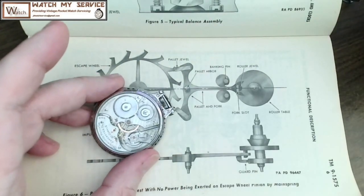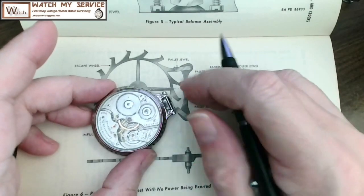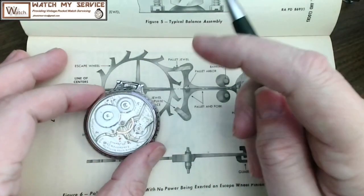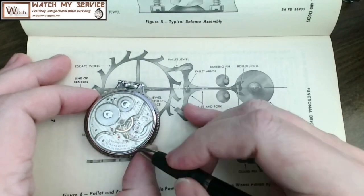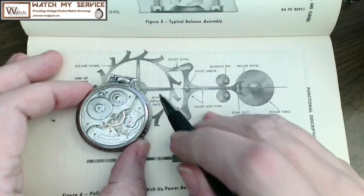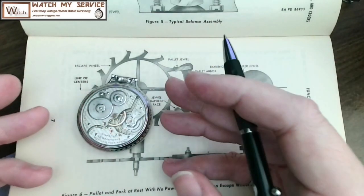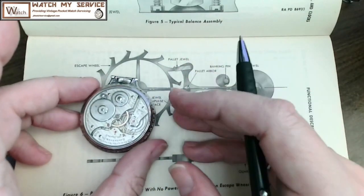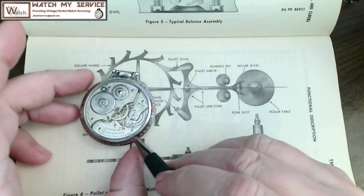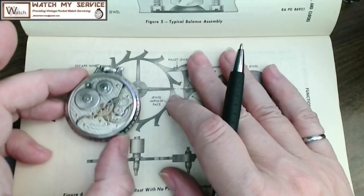So that does happen, and you can get loose screws from improper maintenance of a watch, where the screws are not tightened properly, and they'll come out. Sometimes it's just forgetting to do it. As you've seen when I'm repairing a pocket watch, I'll put the screws in the plate, and I won't screw them down tight until I know those pivots are poking through the jewels. Otherwise, I'm going to take the pivot on one of these wheels and bend it. So I do that first, make sure everything works, then I tighten the screws down. But if I forget to tighten the screws down, I put it all together, the thing seems to work, there's no issues. But over time, that'll rattle itself loose and could come out, and then you've got this loose screw around. Or if it comes loose, the plate will ride up and the pivot will come out of the jewel, and then everything will go to hell in a handbasket.